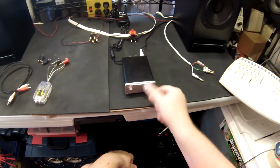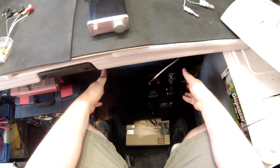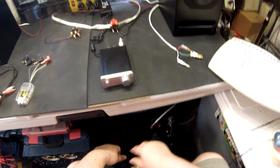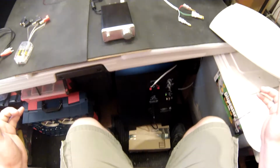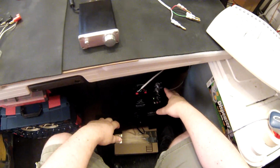And what that does is allows the volume knob on your amp to control the volume of the sub and the volume of the speakers. On this Martin Logan 300, it only has level ins, which means you either have to run the speaker wire down and then put another set of speaker wires in the exact same holes and run those to the speakers, giving full range to the speakers, and then you adjust for the crossover that naturally occurs.